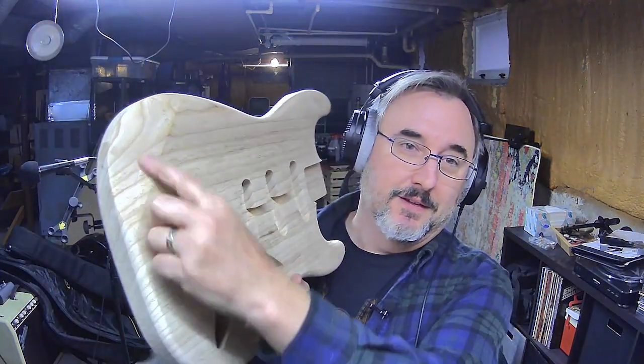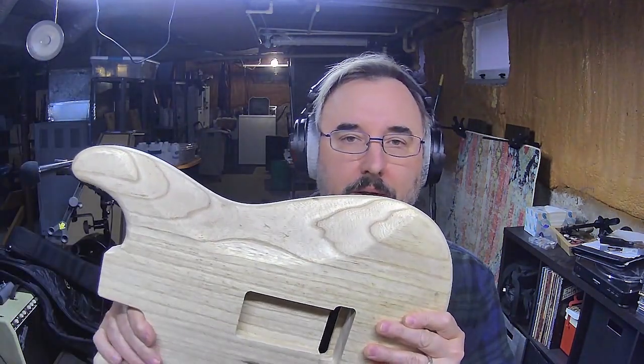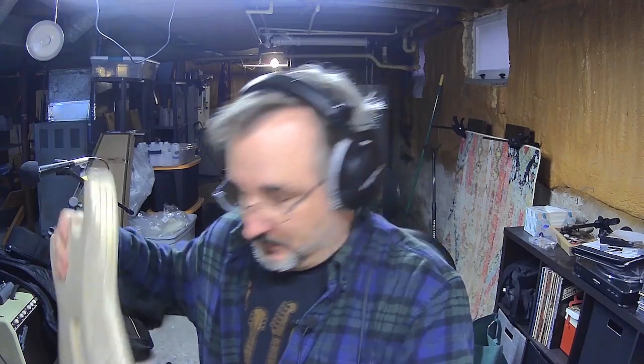This is what it normally looks like. That's pretty good. It'll definitely be better with a good bit. So I'm going to use an eighth inch ball nose bit that has a 1/4 inch shaft, so you don't have to use that adapter. Then the chances of it slipping out as it cuts is pretty much nothing. And I'm also going to try a 1/4 inch ball nose.